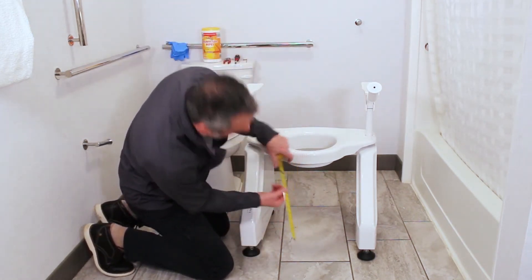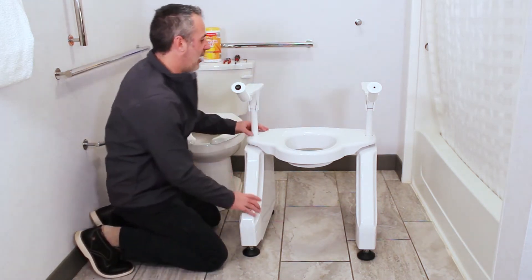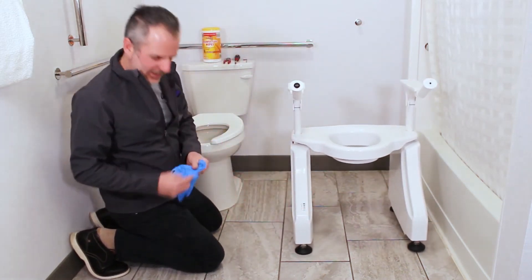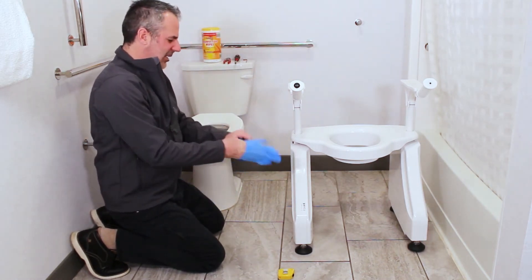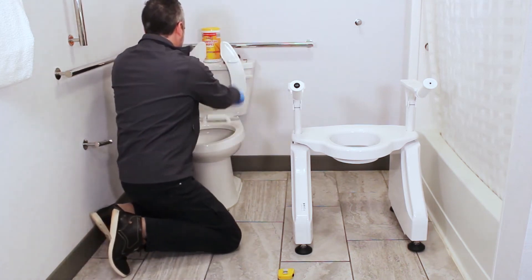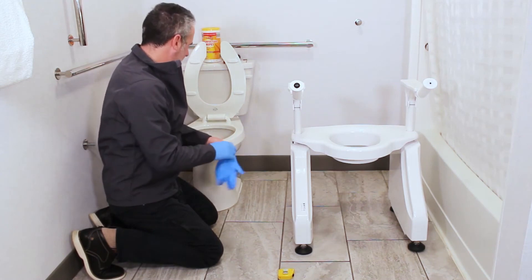There we go — we're at about 17 and a half, so we've got our height right. Next thing we're going to do is take off the old toilet seat, which is actually a little easier than you think. Toilet seats are usually just put on almost hand tight, and they usually have a nylon fastener. Sometimes you have to flip up a connection and find a screw head, but this one doesn't have that — it just has a one-piece, which is even easier.